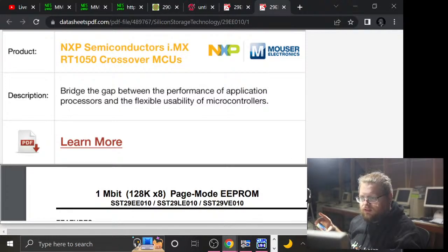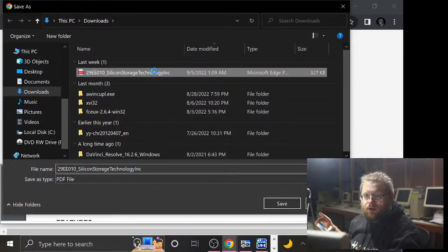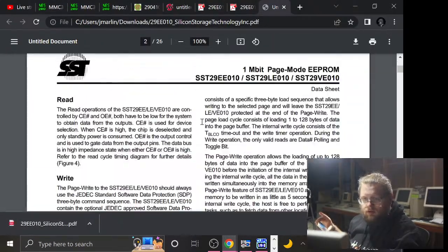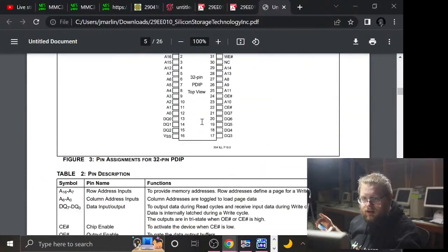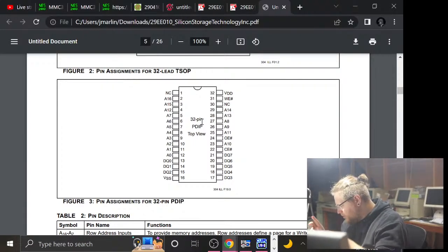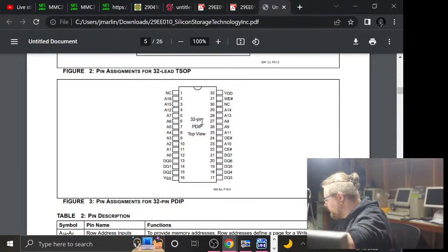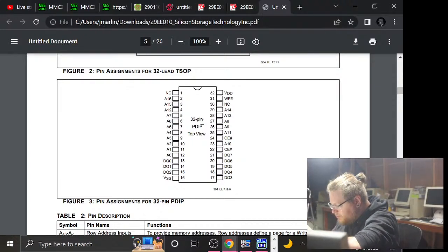Oh, and I totally downloaded this too. Totally did. Yep, it's right there. Sure, why not? And then open it, which I could have just done in the first place. Give me pinouts, please. Pinouts, there we go. Yes. So, yep, that is right, Nable. I am correct. So let me just bridge those two pins and take that wire off of there. And then I can hijack that wire off the board to steal the SRAM chip select signal from.